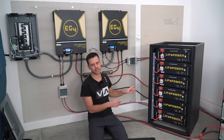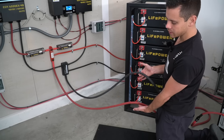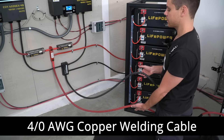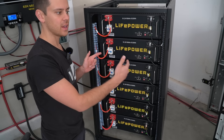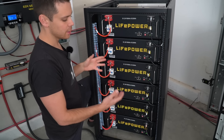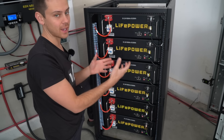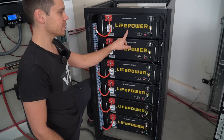The next step is connecting this battery to the main solar power system. The recommended cable size is 4/0 gauge — these can handle the current that the bus bars can safely deliver. How you connect to these bus bars will determine how much current is fed in and out of each battery; that is called current sharing. Because this is a bus bar system, if we connect the main conductor at just one end, one battery would be cycled faster and another slower — meaning one would die before the others.